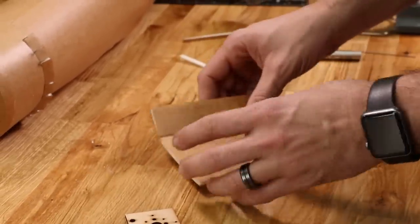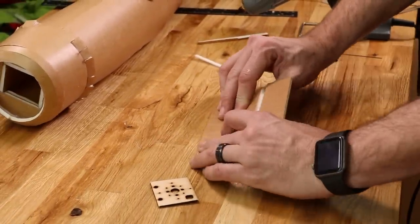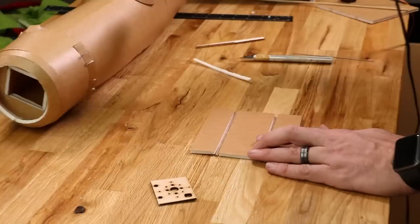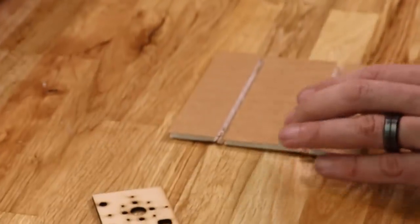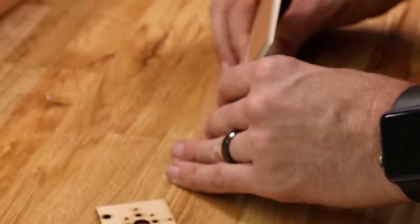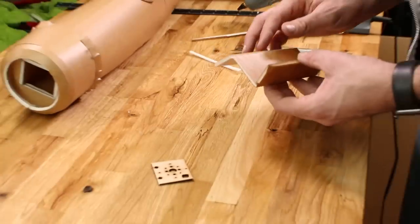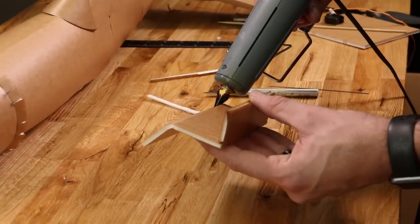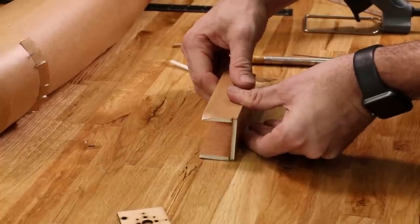And our next step is to do an A-fold. Once again, A-folds is where the side plates go above the bottom plate. So we'll leave the side plate firmly against the table as we rotate up 90 degrees. Let's go ahead and focus the majority of our glue on the bottom surface of the side plate, up to 90, and hold for about 45 seconds. All right, our glue's dry. Let's go ahead and do the other side. Little bead down on the table, up to 90.